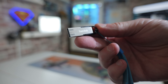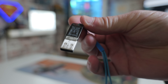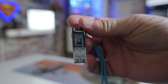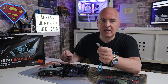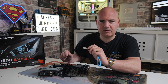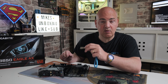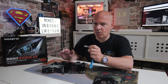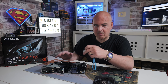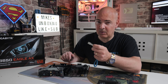You're going to need a USB flash drive. I'm going to use my favourite drive — this is a SanDisk Flare, 32GB. I'll put links in the video description if you want to pick one up, but generally any USB drive will do. 32GB is best because it has to be formatted as FAT32. If you want to use a larger drive, you'll have to create a smaller FAT32 partition on it — we've done a separate standalone video on that which I'll link in the description. This doesn't always work and USB compatibility on these boards can be a little hit and miss, so ideally the 32GB version is the way to go.